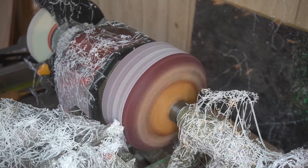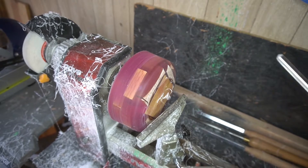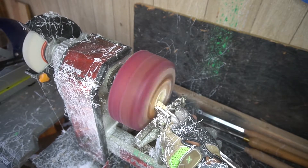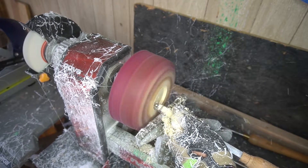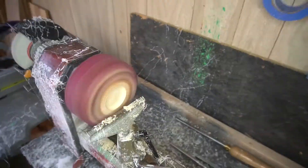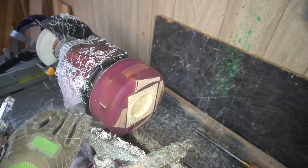By the way, if you're ever needing Tupperware or something to put an epoxy mold in, the Dollar Tree usually has really good stuff for cheap that you won't mind messing up, and they have a variety of sizes. Once we completed that portion, now we're making the mortise — I'm finally learning my lesson on that. This part went particularly well. Using pine board waste blocks makes everything go a lot smoother, so I highly recommend using those as waste blocks. It'll save you both epoxy and effort when making a mortise on the back end of your bowl blank.